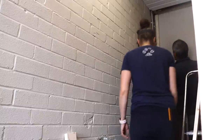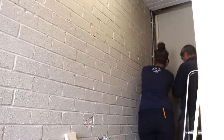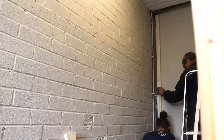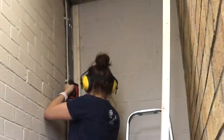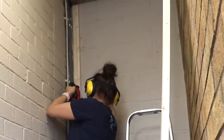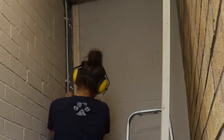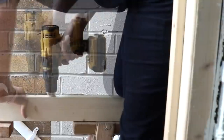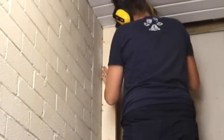Because we had two different widths of timber, we measured and drew a straight line for reference — there are lots of pencil references in this project. Next was drilling through the middle bit into the masonry with a hammer drill. That way, once I'd popped that screw in, I could align the top and the bottom with the pencil line. I used a SPAC screw, also known as a concrete screw — these don't require rawl plugs. Then going back to the first structural length, I drilled more holes through the narrower edge, got it level, and drilled and screwed it to the wall.